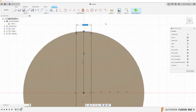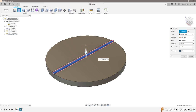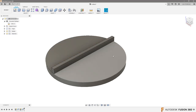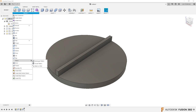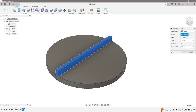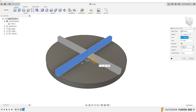D for dimension — let's give this some width. I'm not quite sure how wide these are, maybe three inches wide. I'm going to hit Q for press pull and let's make another one of these, three inches. Maybe this is a bit taller — let's make it five inches tall too. So now we have kind of this crossbar. Kenny has already figured out how to do the bolt pattern with a pattern, so I'm going to do the same thing with these. I'll go to circular pattern — not faces, I'm going to be lazy and select feature. I am going to rotate around the center, make it an angle of 180, and do five of these. Hit okay.